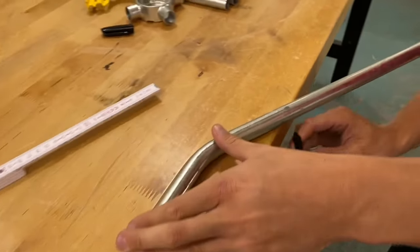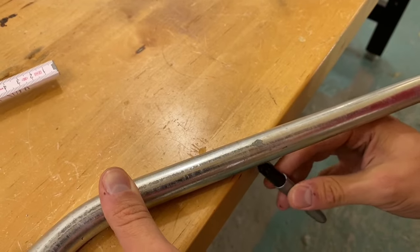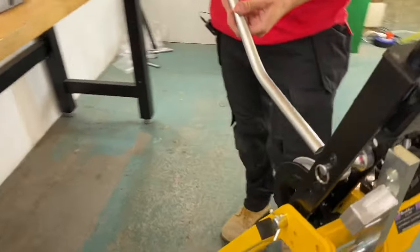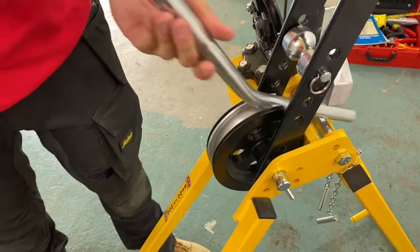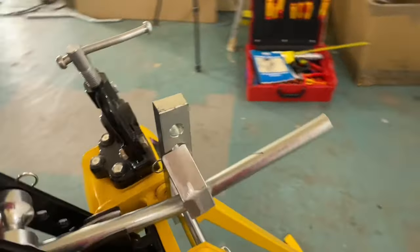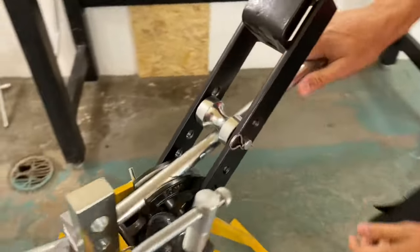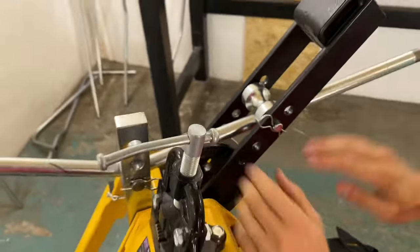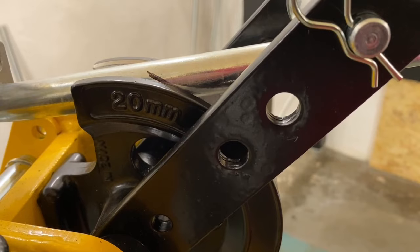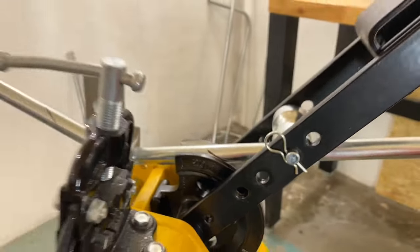I'm going to strike a line here as it comes off — that just moves slightly. So you're going to strike a line where the table returns. If we bend it back there, you would think that would be set at 50mm. It's crucial now where we put that line in relationship to the former. That bend is now pointing up towards the ceiling. It's important that this line is running along the edge of this former here in that direction — where it clashes with the former. So if we bend it back there, according to the table measurement that should be at 50mm.